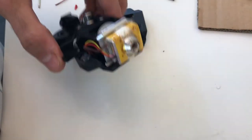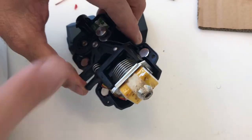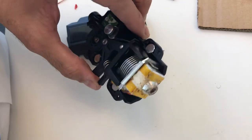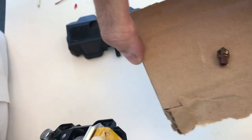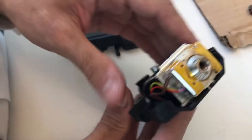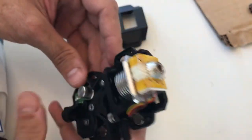The first thing that you do is get this thing super hot — we're talking about 215 degrees Celsius — so if you think you're going to touch this metal piece, you will learn quickly how to avoid getting very intense burns. You're going to take off the nozzle here, which I have on a piece of cardboard because it could be anywhere between 100 and 200 degrees Celsius still, and check to see if there is anything clogged inside the nozzle.